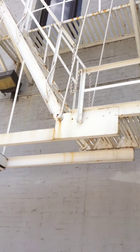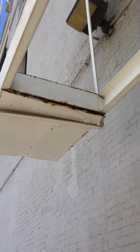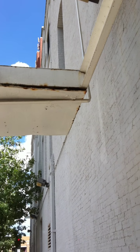First of all, you can see that we have a safety issue because this box, which was all welded and then not bolted, the bottom plate that has all these chunks of steel inside there is popping and ready to drop. So if this thing pops any further, this weight box is going to drop all kinds of junk and debris on top of somebody and can possibly hurt or kill them.